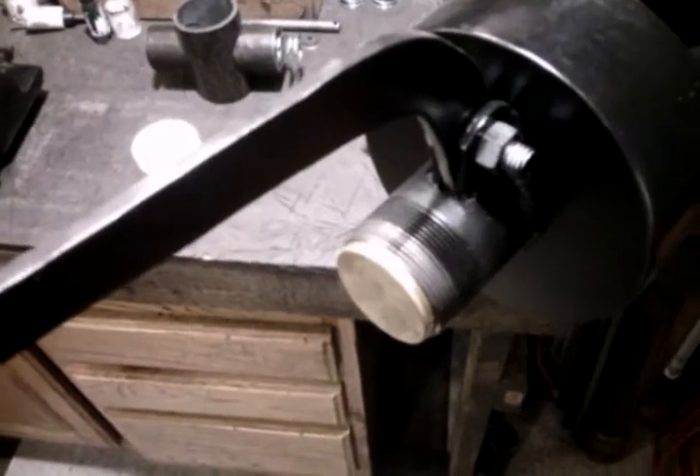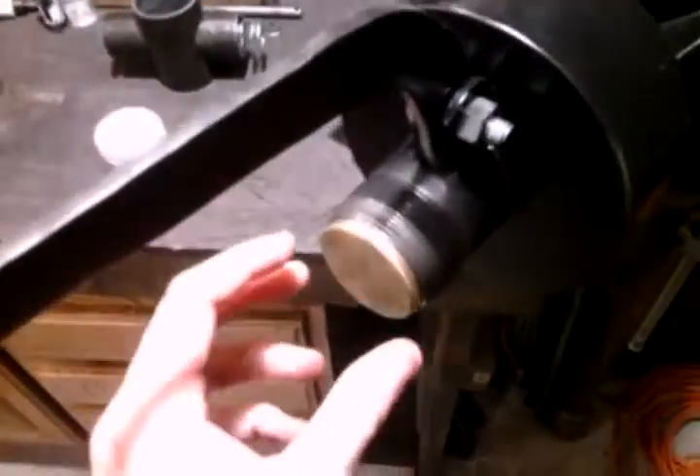You have to do that without the handle on here. When the handle is taken off, put a little bit of lapping compound around the inside chamfered area. There's a little lip right around the surface — that's a 45-degree angle, and the inside of the pipe was machined at a 45-degree angle. What I would do is twist that back and forth quite a few times to allow the lapping compound to take effect. That should give it a nice seat once it's closed under steam pressure.